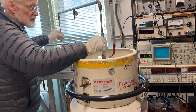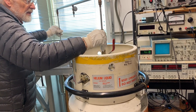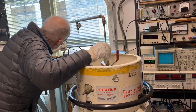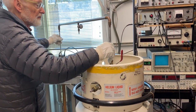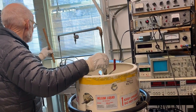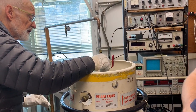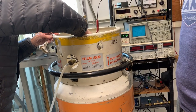After the big boil-off, typically what I do is try to close this valve, capture some of the boil-off gas, and then use that to start the transfer. That clip is just to keep the tube from going all the way down so the end doesn't hit anything. There's this little pop I do sometimes to move gas along — you can hear that some gas is flowing over. Now that that's blown what it needs to blow, we can proceed.